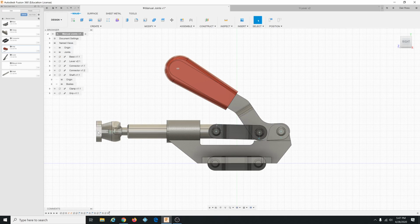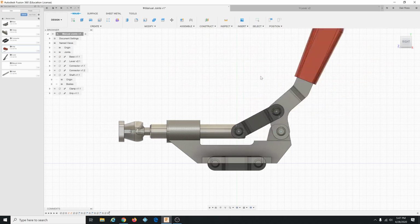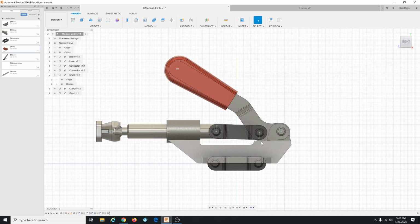So in order for the clamp to loosen, then it would have to move towards the workpiece, towards the thing that you're clamping, which doesn't happen, right? If you're clamping a piece on this, the force is pushing down on this shaft and just locking this thing in here. So this is just an over center locking mechanism is what they call it. So when you pull the lever, for a little bit, it actually squeezes the workpiece more before it lets it go. So anyway, it seems to me that it needs to move a little bit more over center than just in here. I would maybe cut this surface down in here a tiny bit.